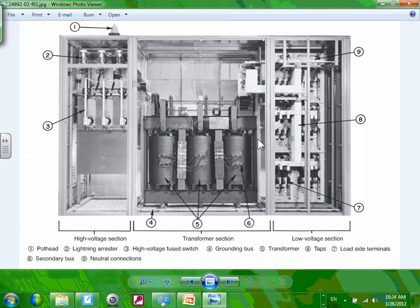Ungrounded system, you measure it with these. We have meters right now to measure it, but with the lights, if you have a ground fault on one phase, the light will dim, and that tells you there is a ground fault in that phase. CTs and PTs, we will do a calculation about CTs and PTs. Any comments, any questions, my friends?